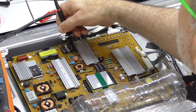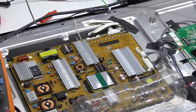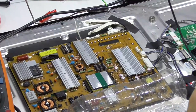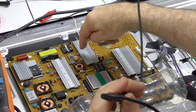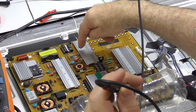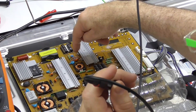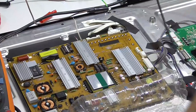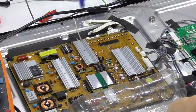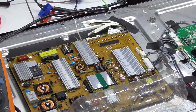And it looks like a DC voltage. Some noise on it. If there's any switching going on, that's on the anode side of the switching diodes. So that's the MOSFET switching through that coil, and the low side of the coil is going into the anodes of that dual diode, and it's got a common cathode. The common cathode is the center leg, which is sticking out further. That's then going to the filters. As I measured earlier, it was just a 0.3 of a volt difference between the anode and cathode, which is the diode drop. And the scope doesn't show any switching going on there at all.